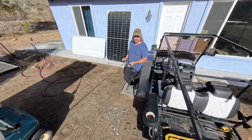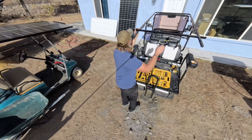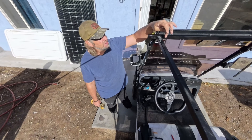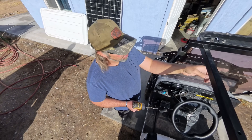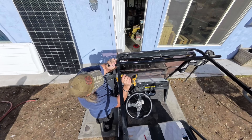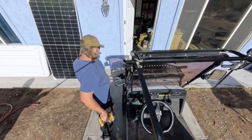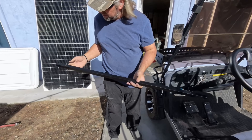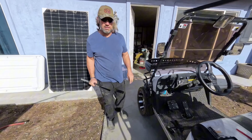I've pre-cut these one inch steel tubing and painted it already, so it's ready to go. We're just going to put these right on here. These are cut to the length — the width of the solar panel. I've put some lines on both sides, half inch from the center of the hole each way, so this is centered from the hole. I've got three and a quarter inches sticking out on both sides. I'm going to clamp this side — that'll hold it in place until I mark this side. We've got our marking holes. I'm going to drill this one and then use it to drill the other three, and then we'll put them on.